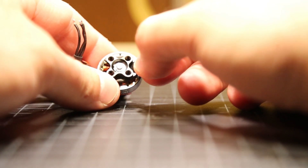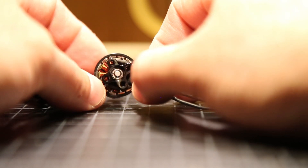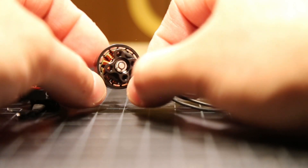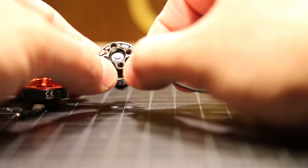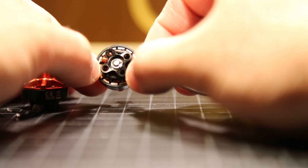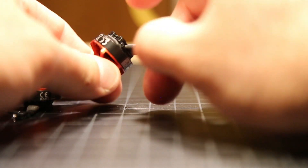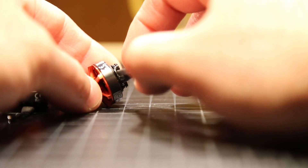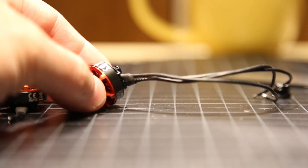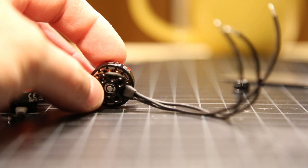Down here there's a circlip — most motors in this size use a circlip since the shaft isn't wide enough for a screw. You can see it has curved magnets and a very tight air gap, so it really has all the modern motor design features just in a small package. Even on the base there's a small channel with a tab to hold the wires down so they don't get yanked out — I've seen this on some Brother Hobby motors but many don't have it, and it's a nice feature.